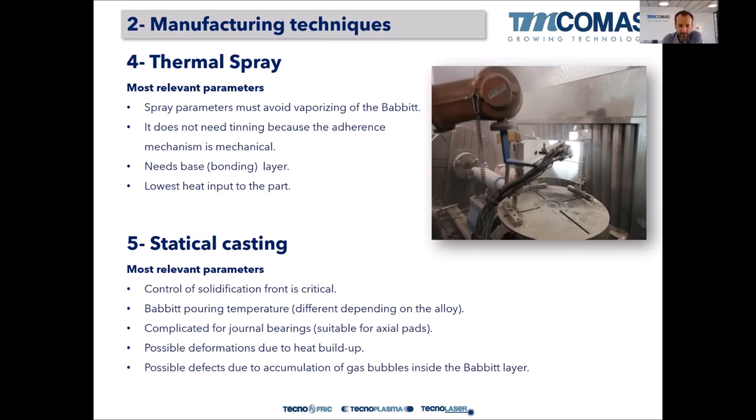The last of the techniques is static casting. It was very much used for very big axial pads because this is a planar surface and it's easy to build a kind of fixture, a kind of pool, where to pour the melted Babbitt and then solidify it. But it's quite risky because it's difficult to control the solidification front from the interface to the outer surface of the Babbitt, for the slag to be there. The risk of having defects is quite high. So we are not using it anymore,